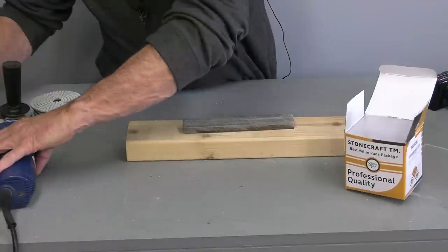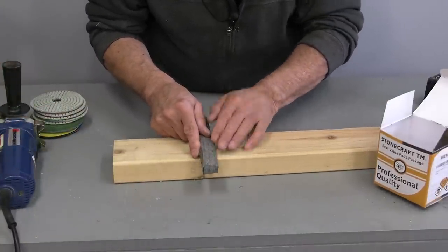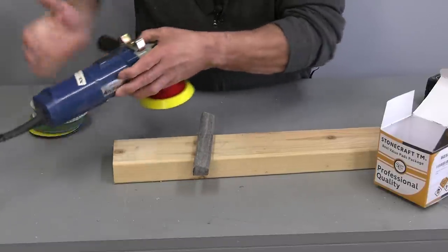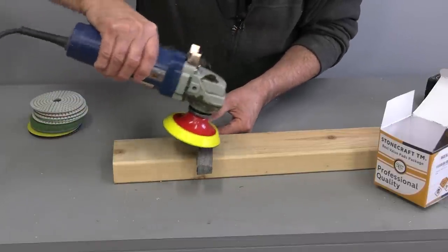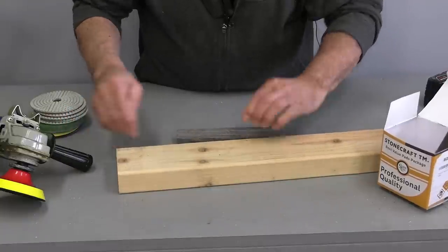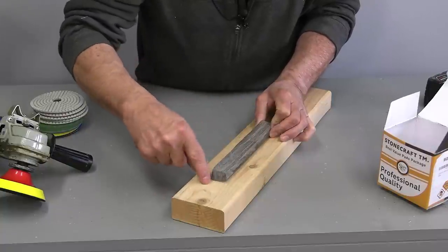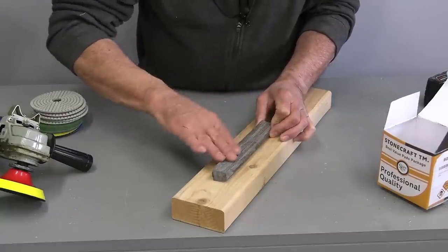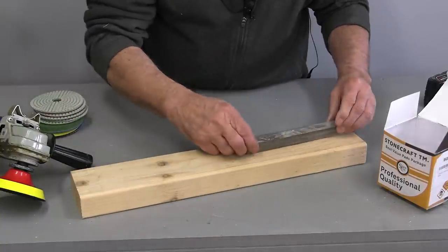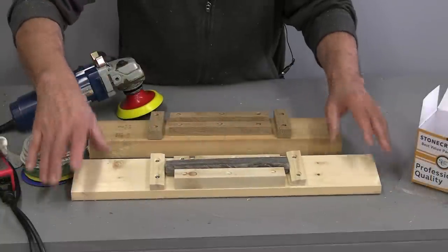The big thing I need to do right now is — because this is at an angle — I want to be able to polish it so that it's flat when the grinder is on it. I don't want to be trying to angle it freehand because I'm probably not going to be very accurate. What I'm going to do is make an angle cut so it will sit flat, then build a cage around it so it's stuck in and won't move. I'll also have to do the same thing with the top — make a little cage so when I'm grinding it's not going to fly off.